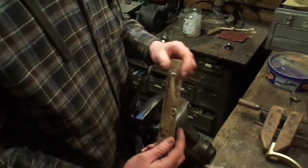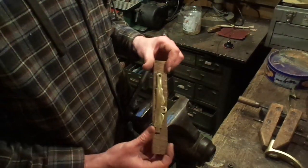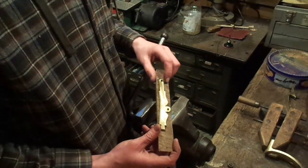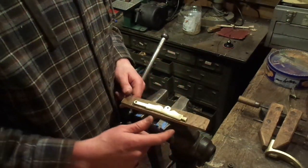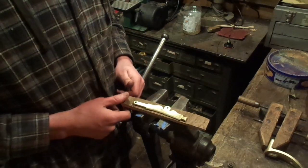For the side plate, super glue it to a board. Only use a couple drops here and there. You want it so it will stand up to the sanding and buffing, but you also want it so you can pry it off.